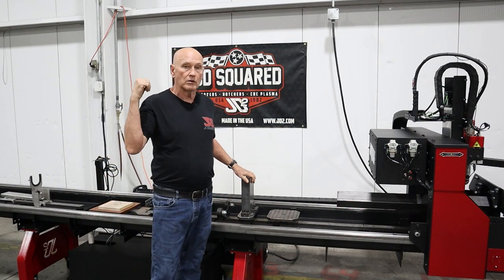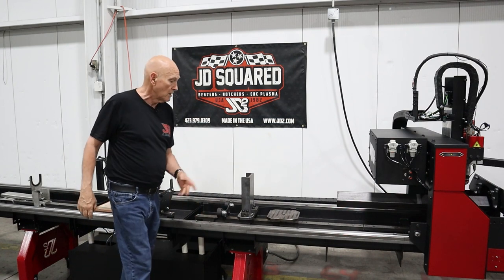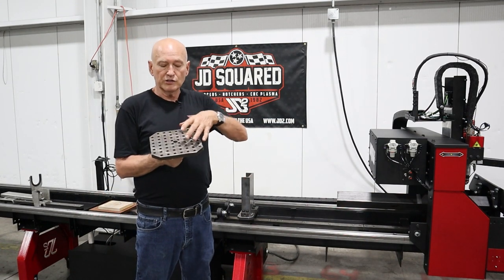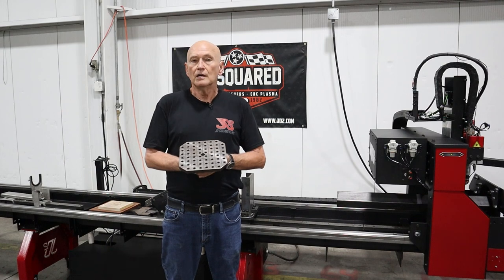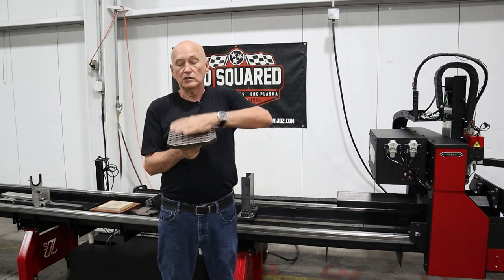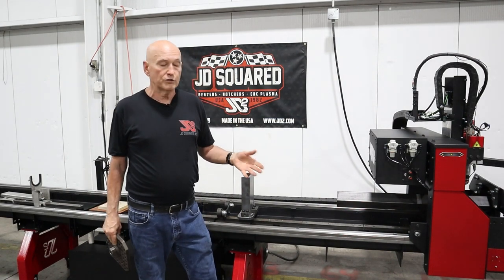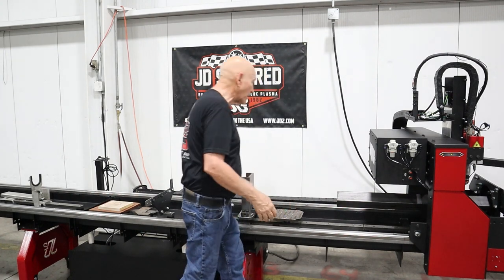On the other end of your structural steel, you're going to run one of those ring adapters to stabilize it, and that ring adapter runs on the rollers. We also sell another piece of tooling called the universal jig plate. It comes with about eight or ten blocks, which allows you to bolt just weird-shaped stuff — an octagon, channel, something unusual. You can position the blocks around and lock it into the jig plate because it may not fit on your chuck. This plate will also grab square tubing, channel, I-beam.